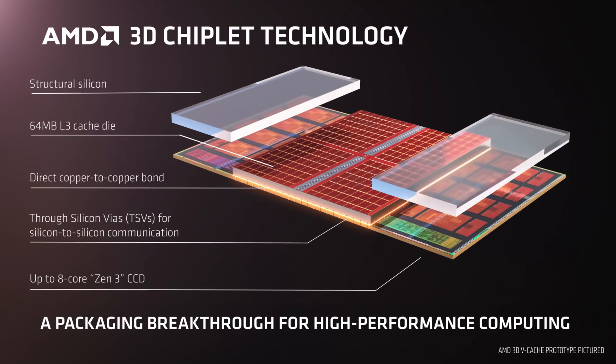Let's talk some technical aspects. AMD is using through-silicon vias, or TSVs — literally a chip-to-chip connection using copper interconnects. This is different to Intel's Foveros, which is more of a die-to-die micro bump stacking technology. With Foveros, you have a chip with bumps and another chip with bumps that connect together. TSVs, on the other hand, are designed to go through multiple chiplets at once. We typically see TSVs in memory like HBM — that's where they're commonly used. The upside of TSVs is that you can stack really high, but the downside is they're mainly used for cache and memory, not really for logic.